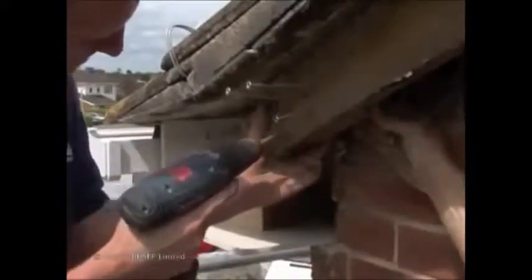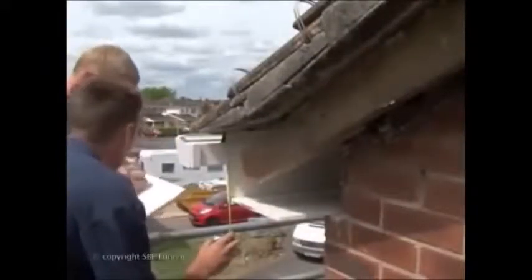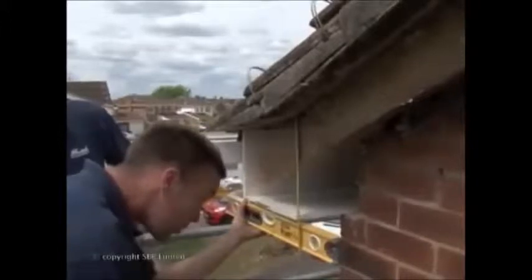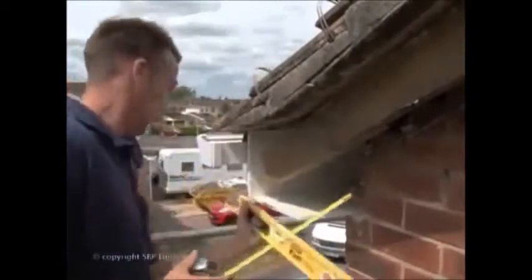Unfortunately, on this installation, the gable ladder is short and has to be extended with extra timber sections to make it long enough to support the box end structure. The measurements for the main box end components can now be taken, starting with the front corner, the back corner, the overall depth of the box, and the depth and height of the return to the gable end.